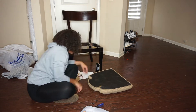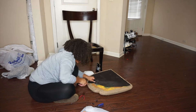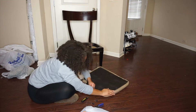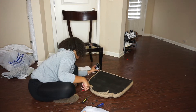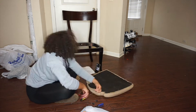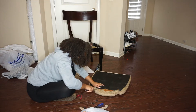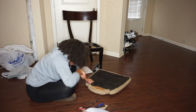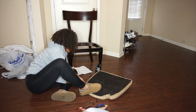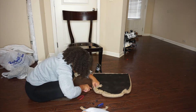I'm just going through and really trying to lift up all of those staples. Depending on your chair, you can have a lot — this cushion had like 300 staples. Once you get the hang of it, you'll be able to get a flow going and just pry them off. Keep going around the entire thing until you remove all the staples, and the cushion should just come right off.